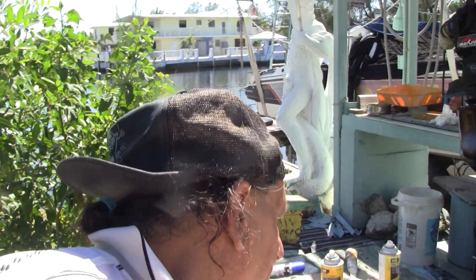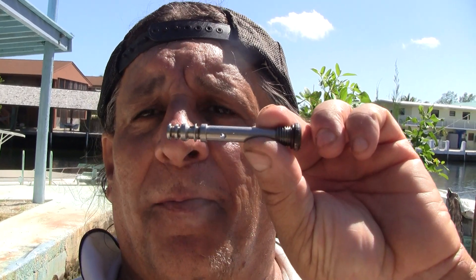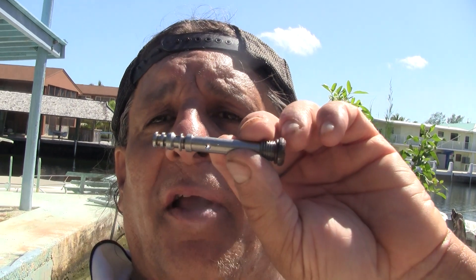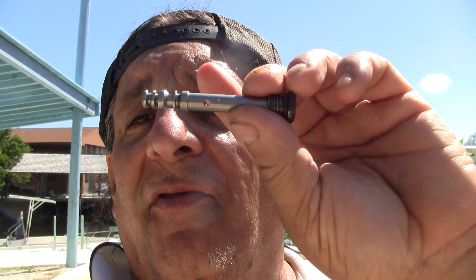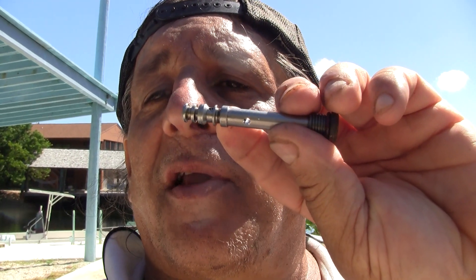These are small actuators — almost like an exciter. When the lever moves through the machine, there's a series of seats where O-rings go. And when you push the valve, one of these O-rings pushes fluid to the master hydraulic pump that sets the machine governor to go faster, so that fluid flows at higher pressure and higher volume. Today's dissertation is going to be how to get the O-rings from one seat to the next without damaging the O-rings.